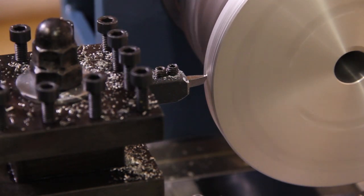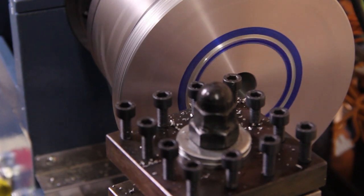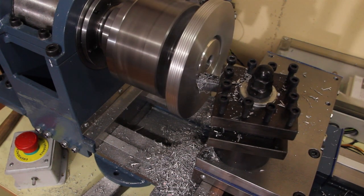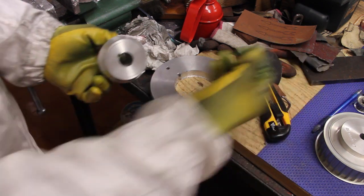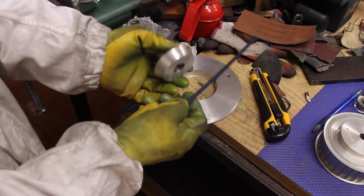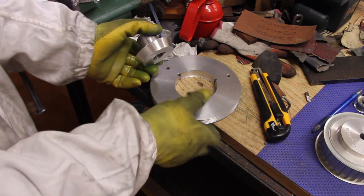This is a beautiful sound. Because I don't have yet enough torque, I exploit the kinetic energy stored in the rotating mass — or said in simple words, I use the inertia to overcome the lack of force. I've broken the tool, so I had to finish the last millimeter with the hacksaw.